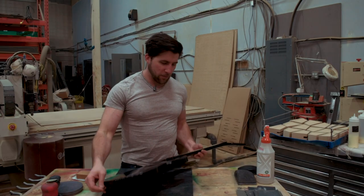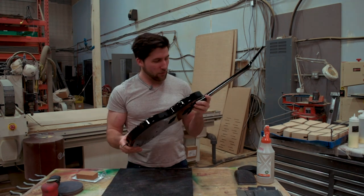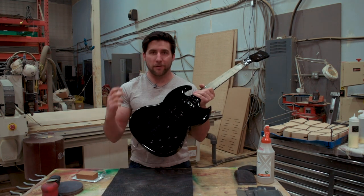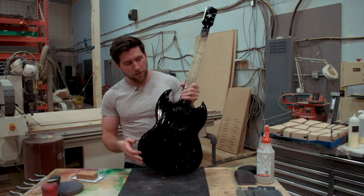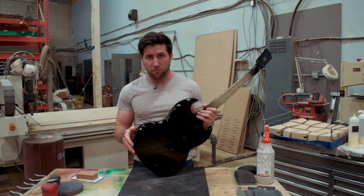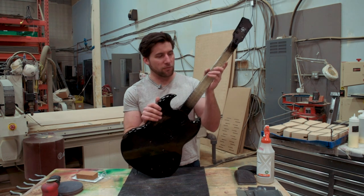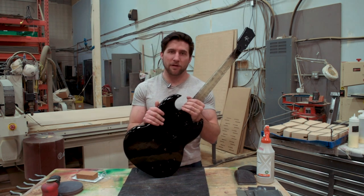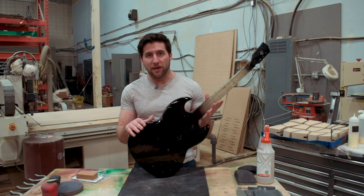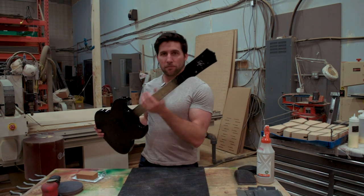This is an interesting finish because we clear-coated it in full gloss and now we're going to knock it back to a vintage semi-gloss — that's how I like to do most semi-gloss finishes. Gloss clear is clearer; the additives in semi-gloss, satin, and matte clear coats do impact them, especially when layered. I wanted a nice thick build, so I did three coats, sanded with 800 grit, then came back with another three coats — six total.